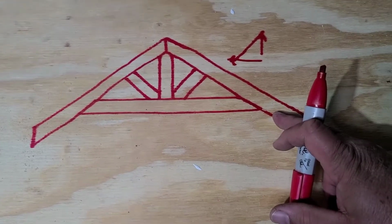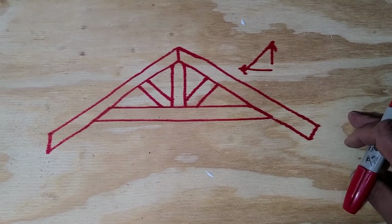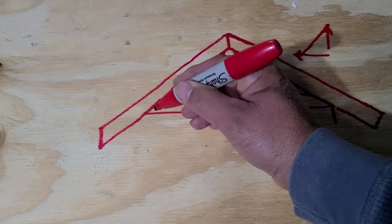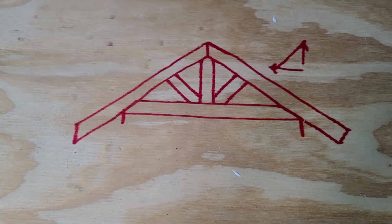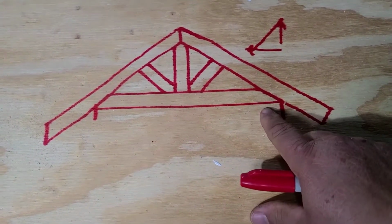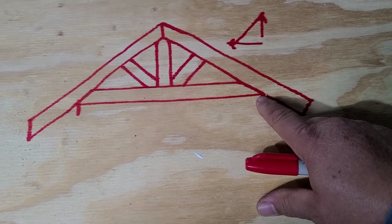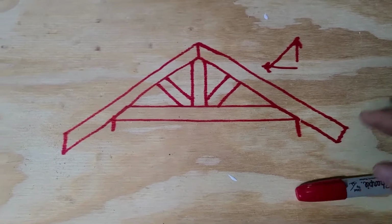If you've seen that in the videos, if not, you'll see it soon. So say you want to build a truss. You know this measurement here is the width of your building. So you know your bottom chord is going to be, if your building is 8 foot wide like ours is, your bottom chord is going to be 8 foot wide to the long point of your angle cut. So let's talk about how to find your angle cuts.